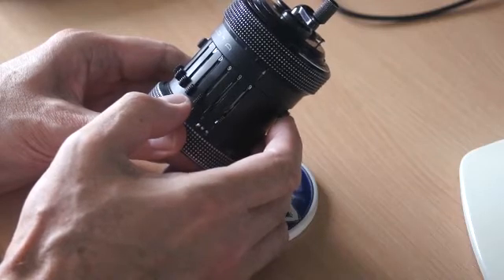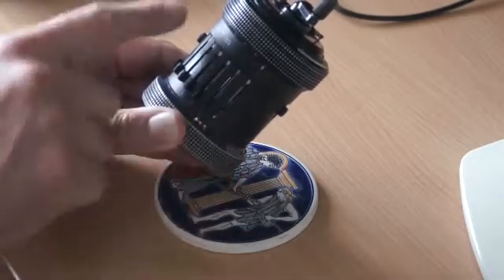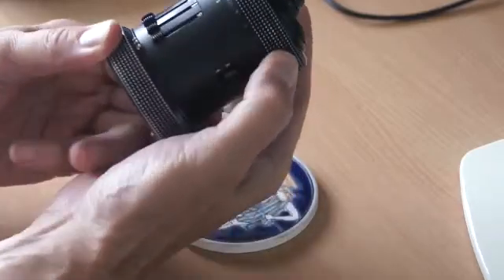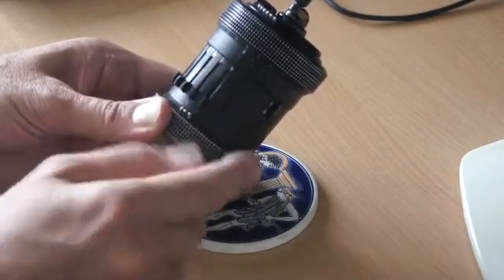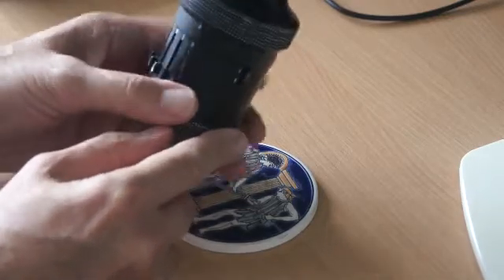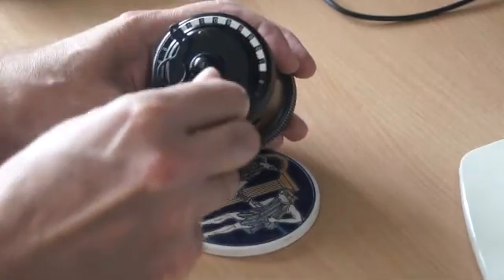What we want to do now is multiply that by 10 to the 7, and to do that we move the multiplier ring around until the 8 is above the arrow. So we are now multiplying the 7 nines by 10 to the power 7, and that will happen with one rotation of the handle — 7 nines by 10 to the power 7.